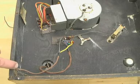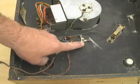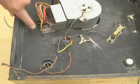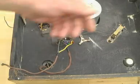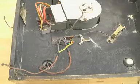The mains lead entered here and ran down to this three-way clamp. It then went via a switch here into the tag strip, and the other end of the tag strip, the other end of the winding, or the gubbins, goes back out to the mains. So we just abandoned the use of the switch. These two wires are earth wires.